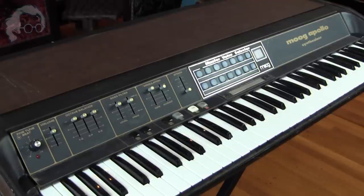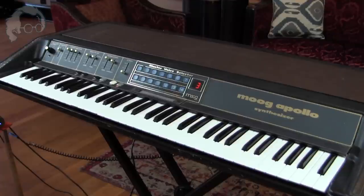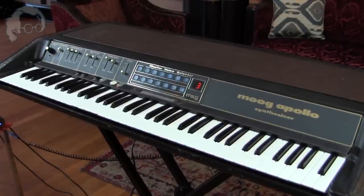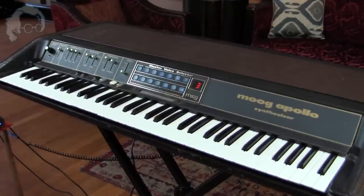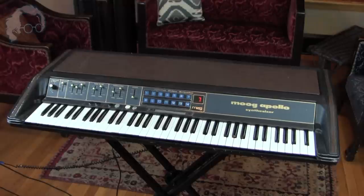And this is a much maligned sort of synthesizer setup because it either becomes extremely expensive or extremely limited. And here's how. Usually, all of those notes need to have, for us to be really happy, individual filter articulation and amp articulation. If you take all of those notes and put it through one filter and one amp, you'll get restarts, re-triggering every time you play multiple notes while you're holding down notes. And that is not a pleasing outcome for most synthesizer players. So that's kind of been the problem with divide down synthesizers, is that you have that limitation.